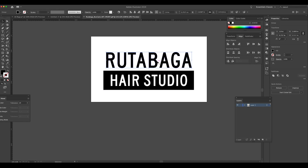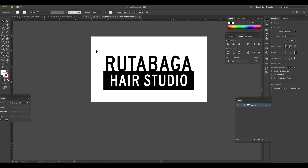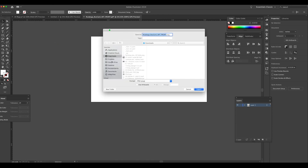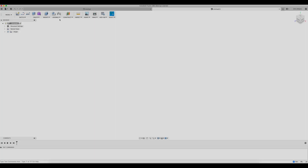John was kind enough to send over a PDF of the logo itself, so this is much easier to do in Illustrator than it is in Fusion 360. Let me move down here and make sure that's a vector. We'll export that out and save it as an SVG. Some people do the DXF file, however I haven't found it really translates directly. SVG is definitely the way to go.